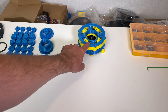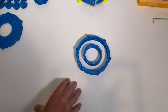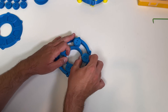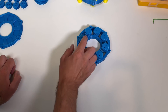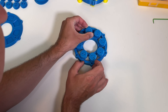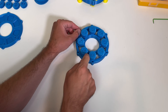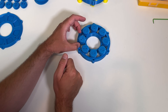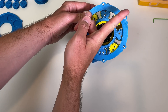Let's start the assembly with the compound planetary gearbox. This is the output gear and this is the sun gear. We need to properly place all the planets — this is more or less a random position and I'm going to align them afterwards. Now the planets have the right distance between them and I need to look at the orientation, because this is quite important. When this planet is radial like this, this one should be perpendicular to the radial position. Here and here it should rotate exactly as shown.